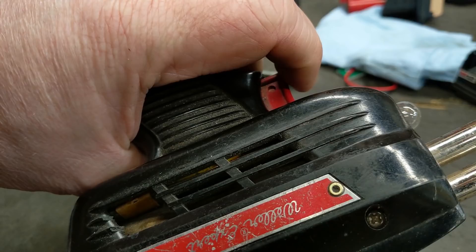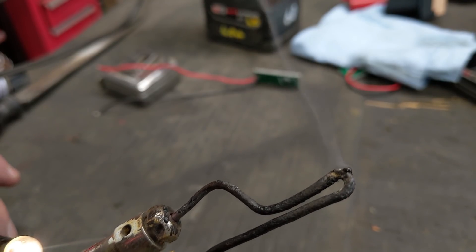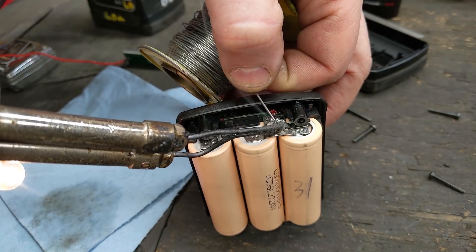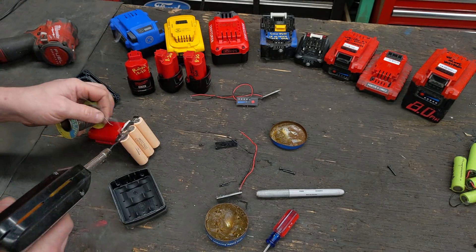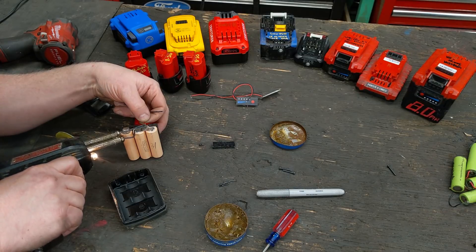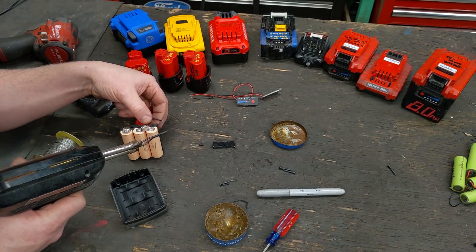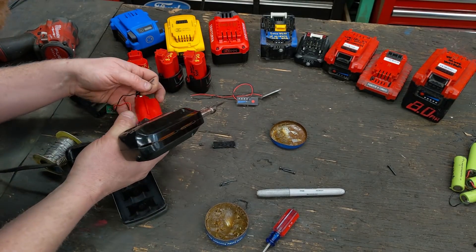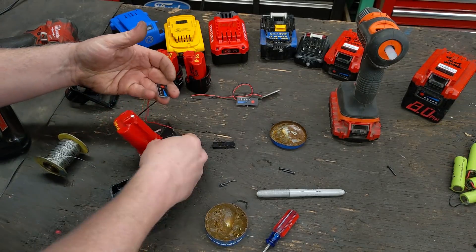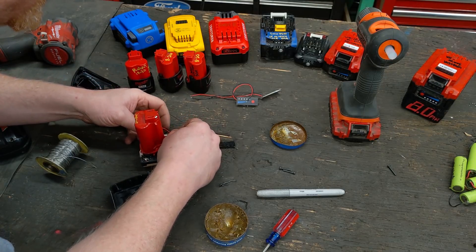I'm going to pre-tin them before attempting to do the wiring. I'm going to get the tab as hot as possible — I'm using a momentary soldering iron. All we're doing is getting a good glob of solder on there — that's pre-tinning. Since both sides are now pre-tinned, all we have to do is just touch it instantaneously and it's good. We don't have to sit there and dump a ton of heat into it. Do the other side the same way. Now just tuck these wires where they're not going to interfere with other wires.